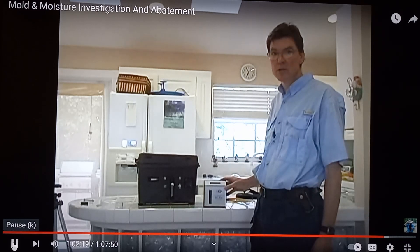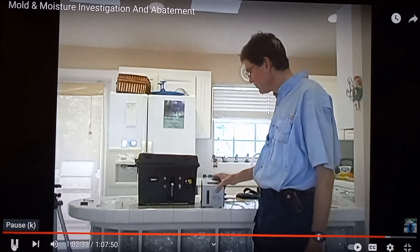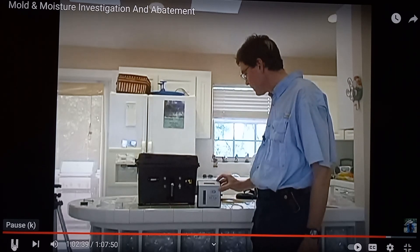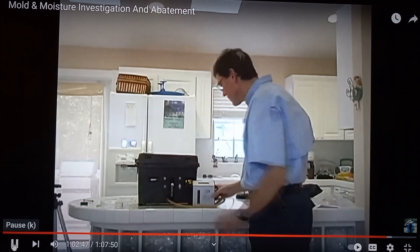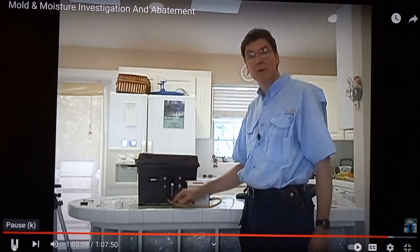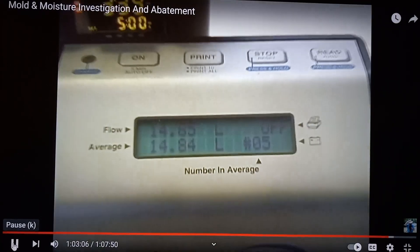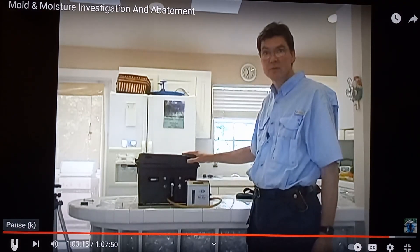This is an example of a primary calibration device — there are different products and manufacturers. You turn on the power to the pump, turn on the pump, turn on the primary calibration device, and set it to read. This is the inlet nipple on the calibrator and this is the outlet — it draws air through the hose and into the pump, and measures the flow. It reads 14.88 liters per minute, meaning this rotometer is within calibration at 15 liters per minute.